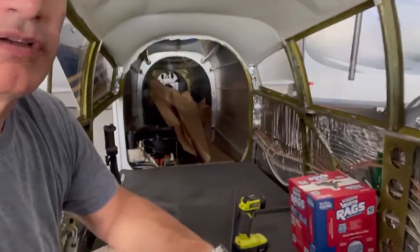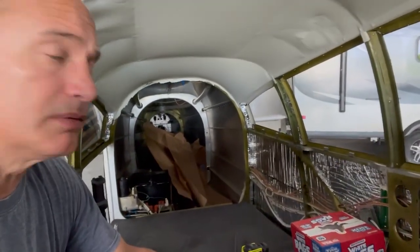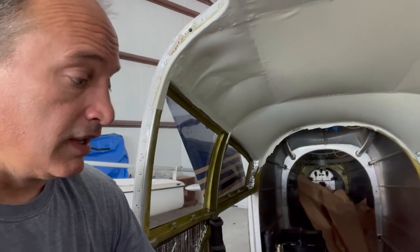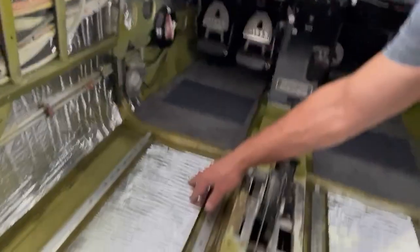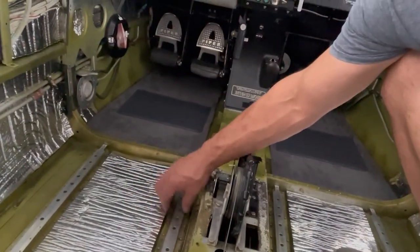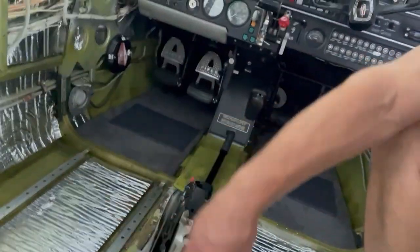Here's where I'm at so far. I've got the board that covers all the hydraulics and the lines and cables — that's covered, trimmed, and in place. Behind that you can see the floor of the luggage area, that's covered, and I've got the soundproofing down under that. Up in the front, we've got soundproof insulation underneath the floor carpet and that has been glued into place. Underneath the two front seats this is adhered down — I left a little bit of gap where the track runs, then put the carpet over that and did a test fit. The track still runs nicely under that, so I'll keep this here and do a strip here as well as on the outside, which will give a little bit of soundproofing for the floor, and then lay the carpet in on that.